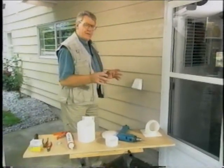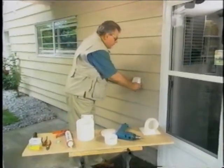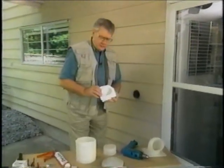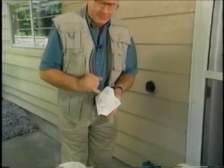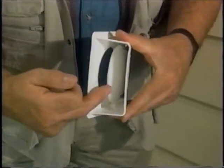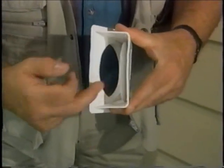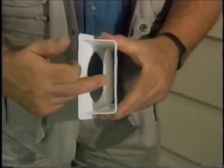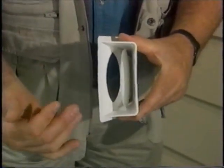I'm going to show you how to get rid of them right now by removing the outside wall cap of the dryer. It's not too difficult to pull off the old cap because there's just a couple of staples holding it in place. But on the inside, you'll notice there's a plastic flapper which can be impeded with lint holding on, keeping it a little ajar, allowing all those pesky critters to crawl up the wall and right on into the dryer.